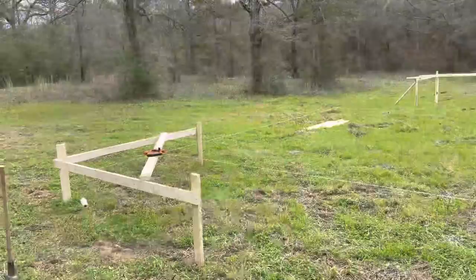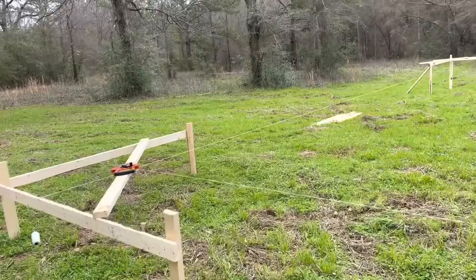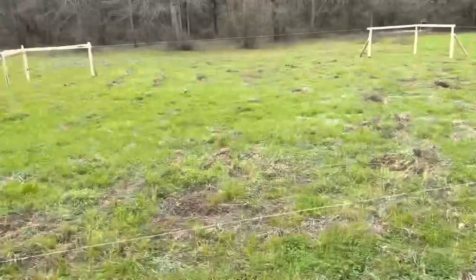I see it right there — 48 by 48, perfectly square. Cross measured it. Now this is good to dig footers. The footings are around the outside. So what we're going to do is dig footings around here, probably 20 inches wide, eight inches thick. Each time I have to step down, I'll step down in eight-inch increments, and that way the block work will work out.